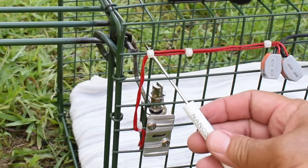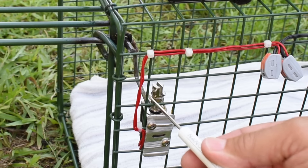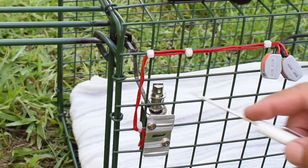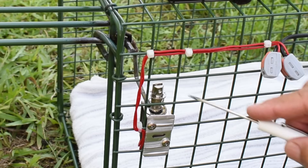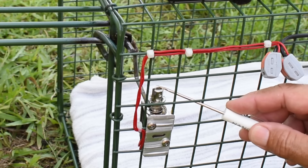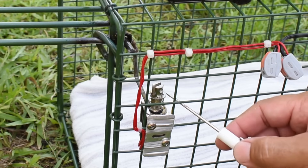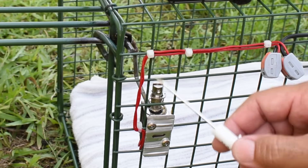When you put this rod in — which you're going to braze or weld onto the door — make sure the angle is correct. It comes in sideways right here and makes contact with the very top edge of the plunger. You want to push this down most of the way. If you try triggering with it way out, you're going to have much less electromagnetic pull on the plunger and it won't trigger the door. So you want to make sure you push this down three-quarters of the way and then engage the door. I also brushed on some silicone grease, and by doing that and ensuring it's down the right distance in contact with that rod, this will trigger perfectly every time.